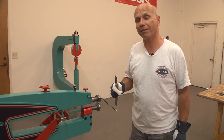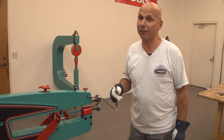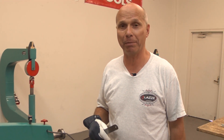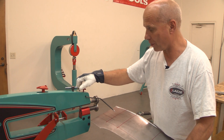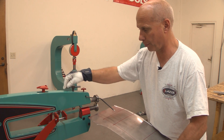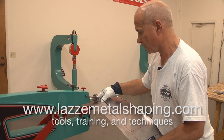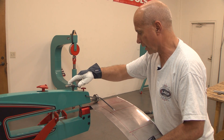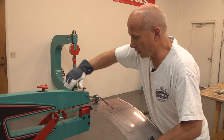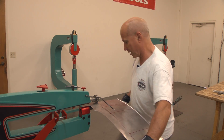This really helps to make a straight line — that's what I'm going to show you now. It's so good to be a teacher because my students teach me a lot of stuff I never thought about, so I can learn five times faster than if I do everything by myself. Watch out now — I'm going to run this bead. I turn the dies all the way together until touching, then turn it up one, two, three turns. I put the sheet metal in there and turn it down — that's one turn.